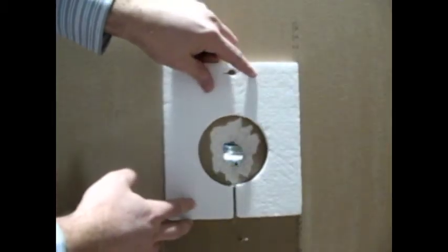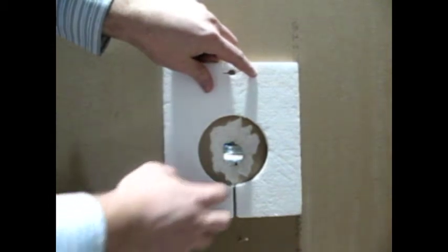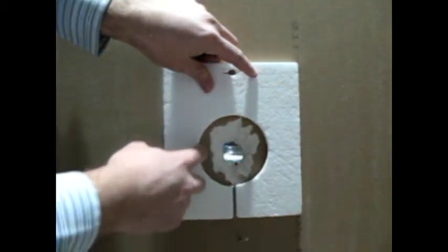In this example, the template is almost too small and borders on needing the larger plug. Yes, the drywall plug may cost a few dollars more, but the intent should be to make a permanent repair that will bring back the integrity of the wall and not just hide the damage. Finishing the top coat is also easier with the drywall plug — most mesh screens need more than two coats to hide the thickness of the screen, while the drywall plug only needs one.